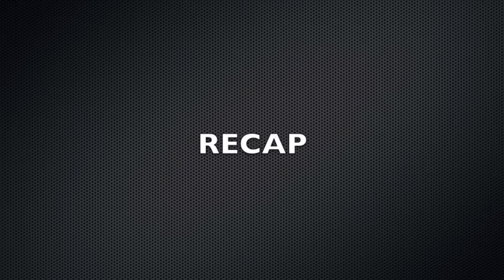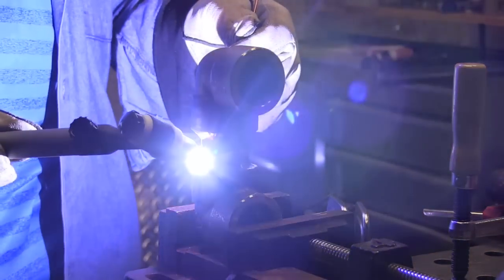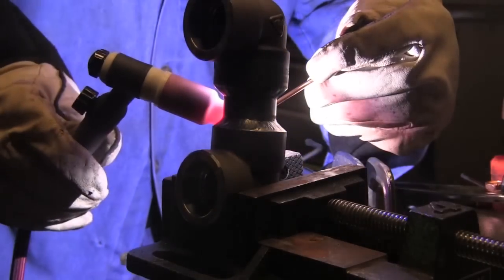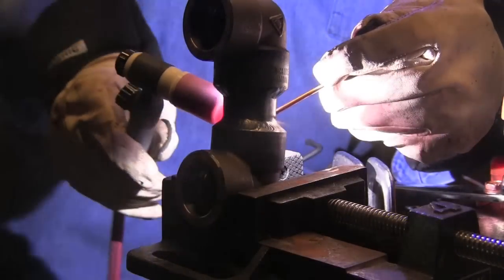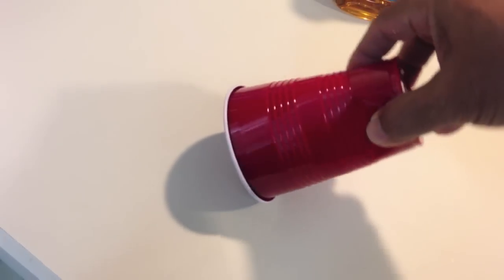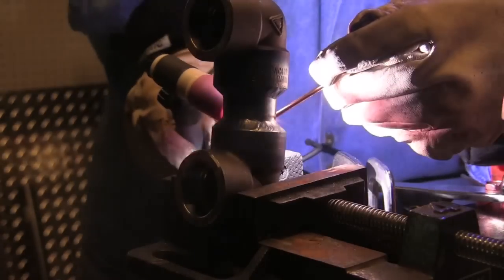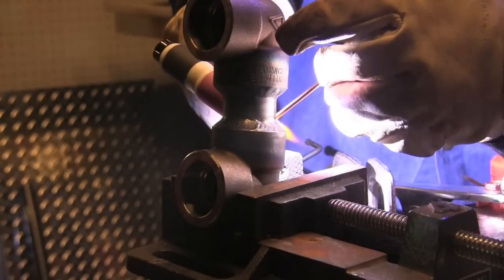Let's do a little recap on walking the cup. For the first pass, I'm using a 3/32nd filler wire and just a slight wiggle — just enough to keep the torch moving, not a very wide weave, so the heat stays directed down to the root of the joint where it needs to be. For the second pass, go a little bit wider, using the full-size gas lens cup. This is akin to walking a 55-gallon drum across the shop floor — not really wiggling the cup, because now there's weld there and I'm having to walk it. The best way I can explain it is like walking a drum across the shop floor, or in this case a red solo cup across the kitchen counter. Hopefully that'll make it gel for somebody not quite grasping the whole concept of walking the cup.